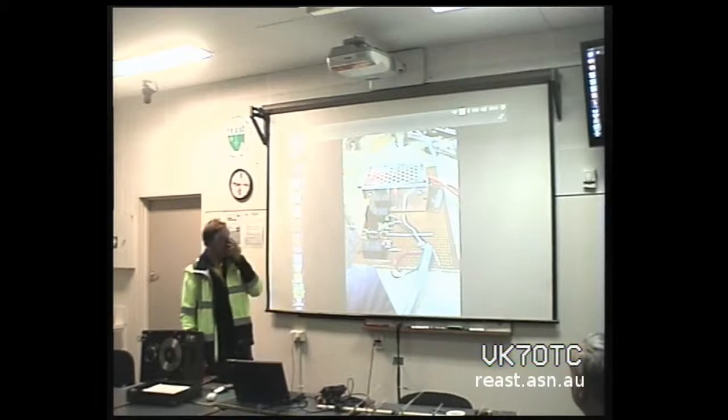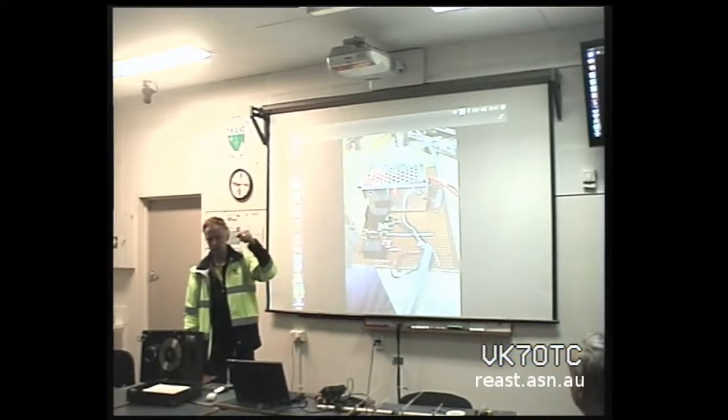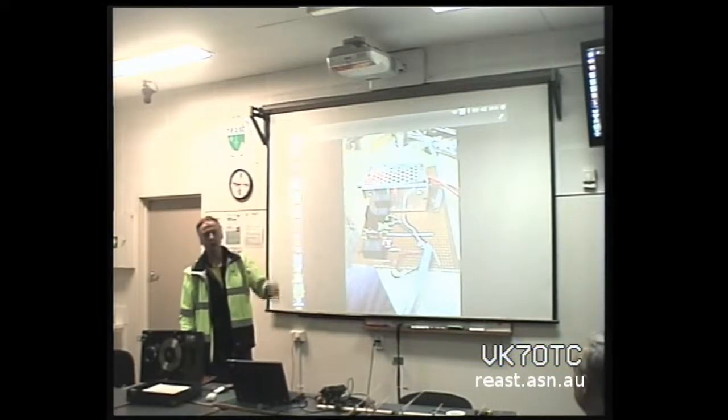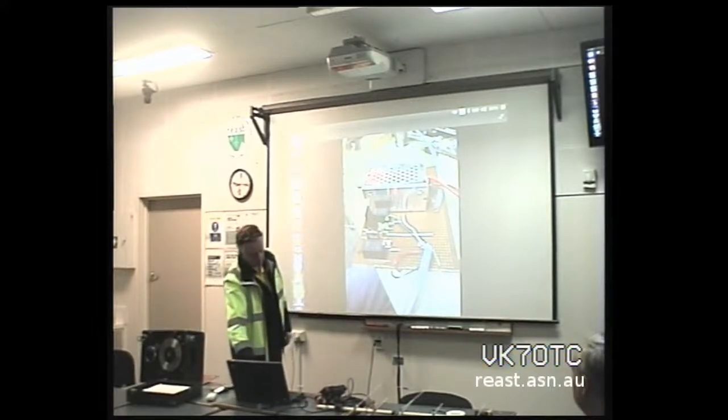That one's just a PWM controller, that little metal box you can buy off eBay for about $6. I had to build a couple of relays, a directional switch, and feedback from the switches up on the antenna so that I knew which way it would go. When I'd reached the ends, it would just turn off. That way you couldn't drive it too hard.